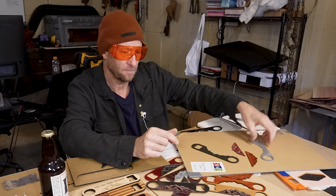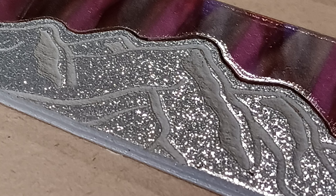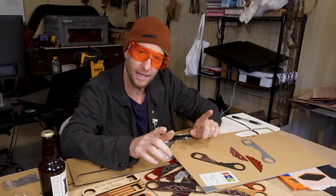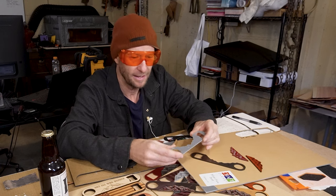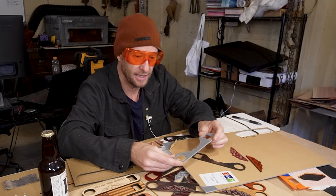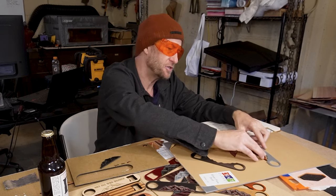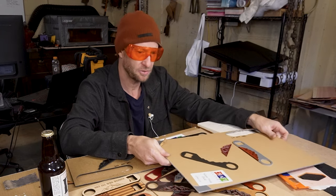This was my biggest surprise of all — Silver Pixie Dust. How the heck is a diode laser cutting through this? It is so reflective. It did take me four passes though — 280 speed, 100%, four passes. Still pretty smooth on the edges, surprisingly, with four passes. No problems; it didn't seem to cause any issues. Cut real well and it's something I can use. Very happy with that. I'm mixing and matching it and I think it makes a really nice contrast. There's going to be a lot of use for this, especially for earrings.